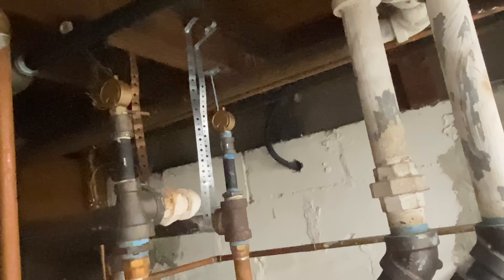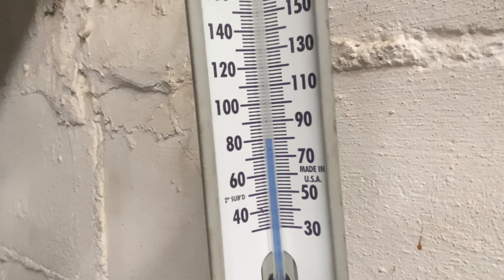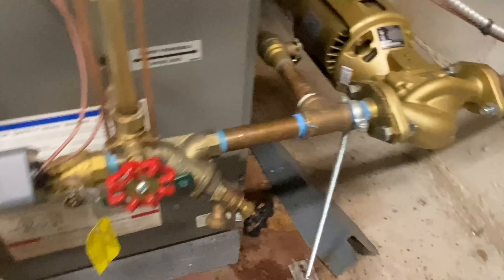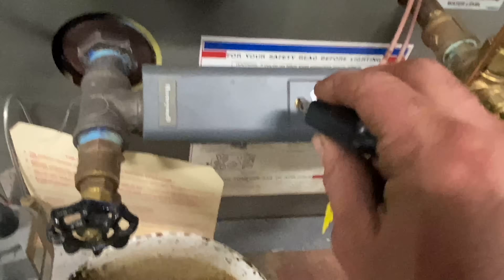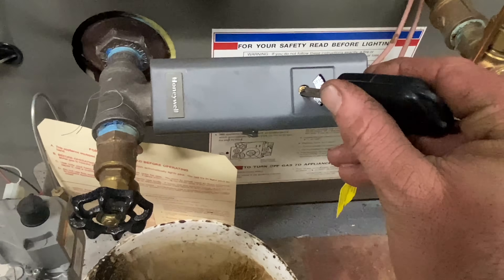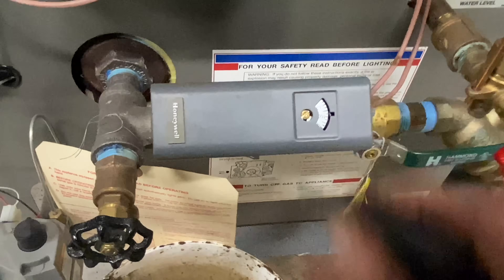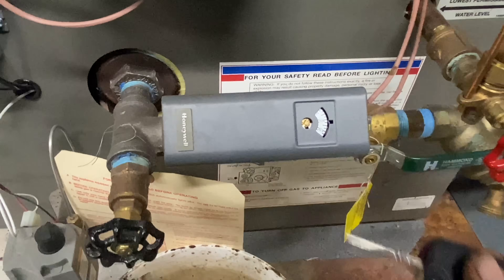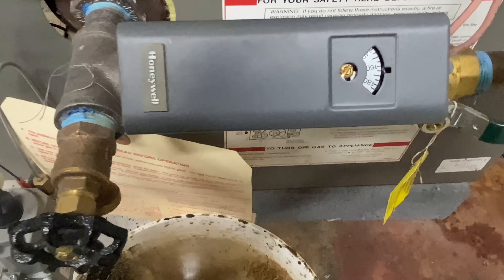I do like the separate air vents per return line. It's warming up to 80. That means this will actually cycle like it's supposed to. And I don't like 180 - too close to flashing. Let's go 160, because we don't need to make steam. So it clicked off because of that and back on. Right now the water is about 160 - I heard it wanting to click on, and it's not clicking off. So we're coming back on.